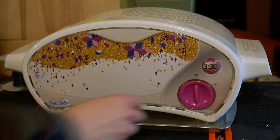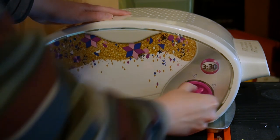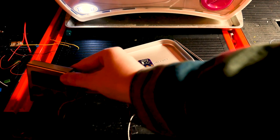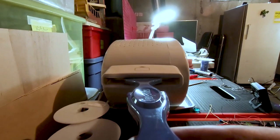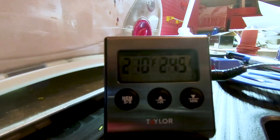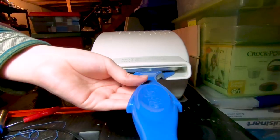The Easy-Bake Oven does not tell you what temp it is internally. The only control is the on-off switch on the front. So to work around that, I used an oven thermometer — stuck it in there so I could tell what the internal temperature was, also purchased from Walmart in January 2020. My hypothesis was that the boards would reach temp around the same rate as the thermometer. So the idea was that once the thermometer read 284, the boards would have hopefully reflowed and everything would be okay. Otherwise there really wasn't a way for me to know what was going on because you can't see inside — it's kind of poking in the dark. So with nothing but some hope and some really loosely strung together theory, I had nothing left to lose but to push the board into the oven, followed by the thermometer, and watch the temperature slowly rise.